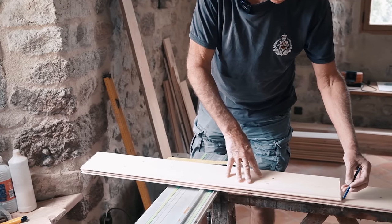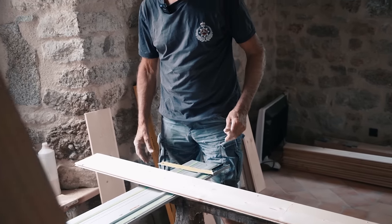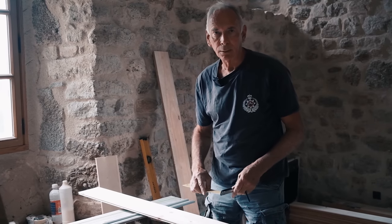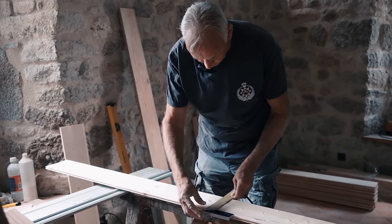So with any woodworking, you need to know that you've got a square end so that you're working from a set angle. So I just measure these very roughly because there's a tolerance of a few millimetres, so we don't have to worry too much. And then just using our set square to make sure that the cut is square. So do it this way.